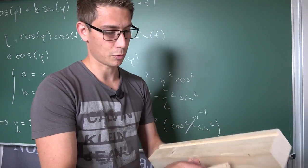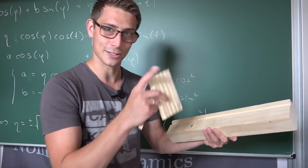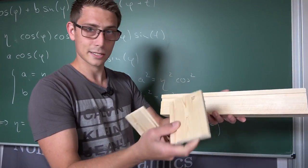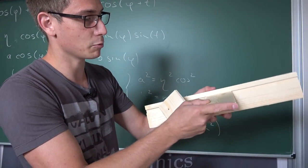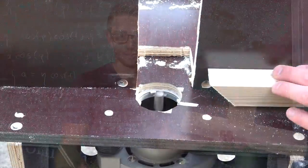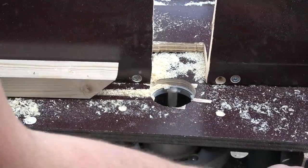This groove — my profiled wood has a thickness of 12.5 millimeters and, incidentally, I had a 13 millimeter bit lying around for my router. We can just put a groove inside of our frame parts and then put our profiled wood into here, and it's going to be very stable overall — it's going to work like a charm. We are going to route two short and two long planks for now, which make up the first floor. But for the second floor we need to be a bit more careful though.